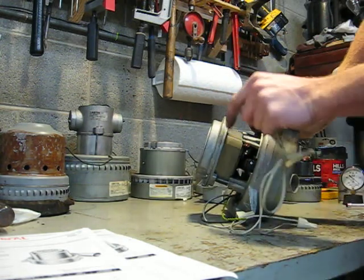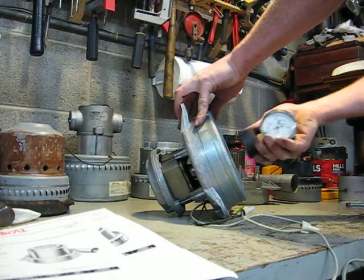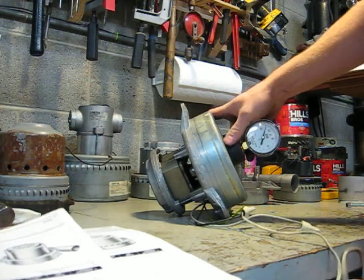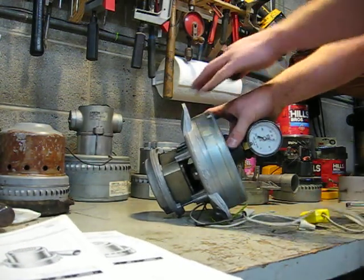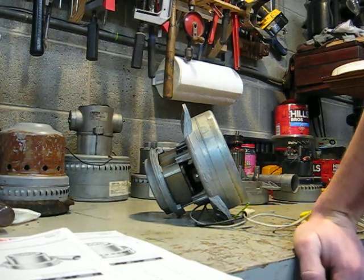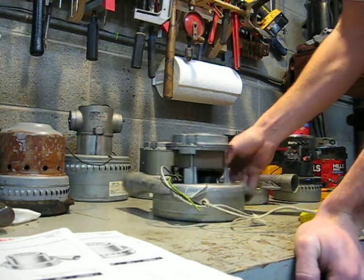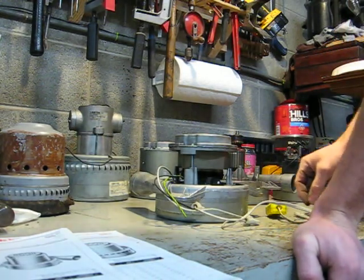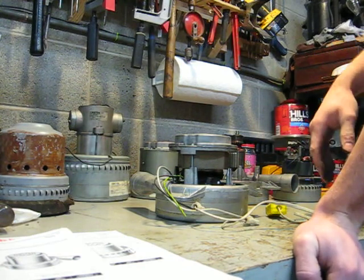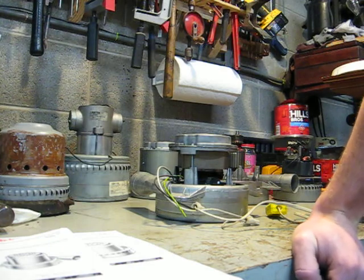Let's try this again now that the field coil is rotated to the opposite position. We got that one up to 140 — from 115 to 140 simply by varying the position of that field coil. But of course, this is done at the expense of motor life, or brush life more specifically. The faster a motor runs, the quicker it wears its brushes out. And the opposite is true also. I thought you'd find that interesting — thank you for watching.